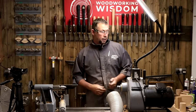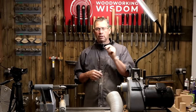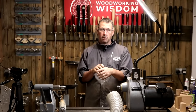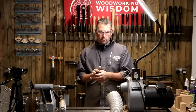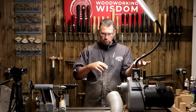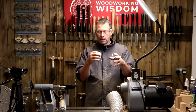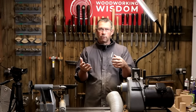Yeah, in terms of what finish you use, that depends on what the project is. So the best finish, do you mean a high gloss finish? Most resilient? Waterproof? Water resistant? Colorful? So many different things. If we're doing fruit bowls, I would always go finishing oil. If we're doing salad bowls, I would always go food safe oil. And it's the technique that you use to apply them. So you sand it in and raise the grain and then put it back like wet sanding and put another layer on.